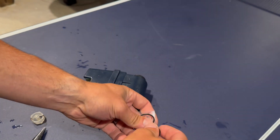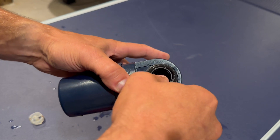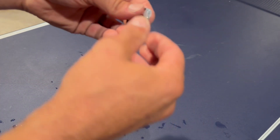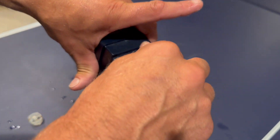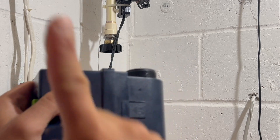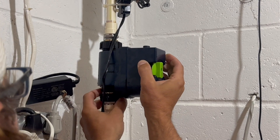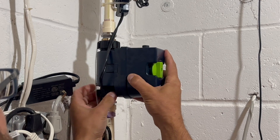For reinstallation, we're going to use the new O-rings. Put a little bit of grease on them — this helps hold the O-ring in place when we put it in and also makes sure we don't damage it during installation. I always like to keep some of this grease in my plumbing box anytime I'm putting O-rings in, so it's nice that Moen includes it. Back at the unit, making sure we're oriented in the correct direction — there's the flow direction arrow going up. Make sure you didn't lose any O-rings, and confirm both are on there before tightening.